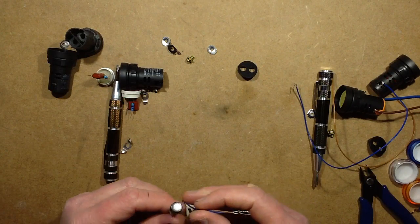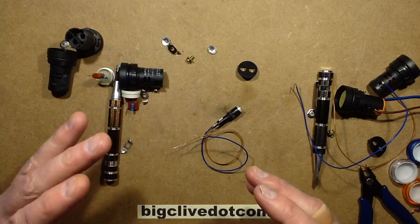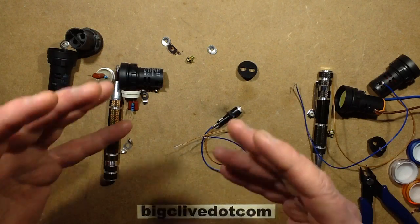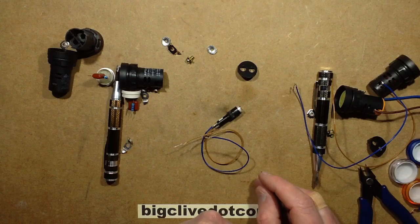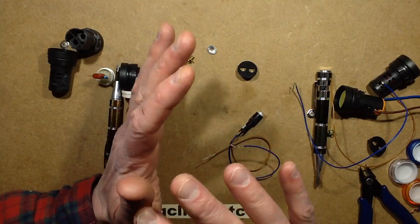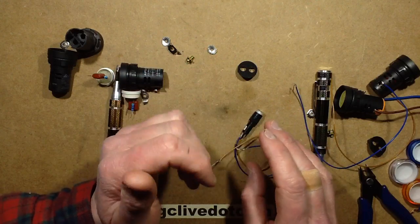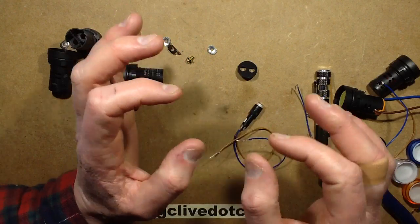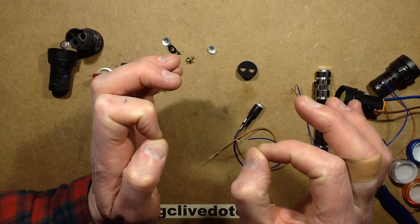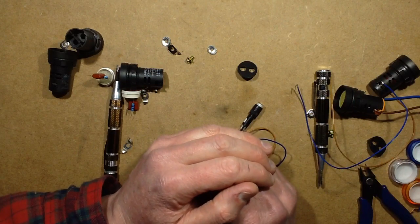And I took the first one off the wall because they were putting new furnishing up, and they were just being removed temporarily, and then they were going to be put back on. I took the first one off, and I measured the voltage inside across the lit lamp. I couldn't turn the boilers off because the factory was still active at that point. So carefully took it off and measured the voltage across the indicator lamp. Just one of these little tiny indicator lamps, and it was 12 volts AC.